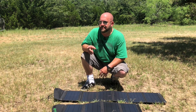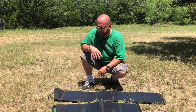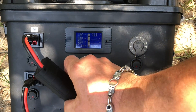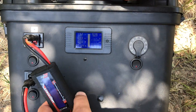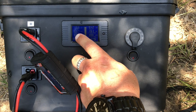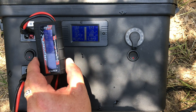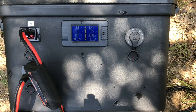Let's hook these up to BigGeek. I've got some inline watt meters so we can see the current going into the battery. Let's plug in the 28-watt panel. We can see our current is ramping up, and we're getting about 1.15 amps. It's about noon on the sunniest Texas day I've had — now we're at 1.2. So about 1.15 to 1.2 amps going into the battery with the 28-watt.